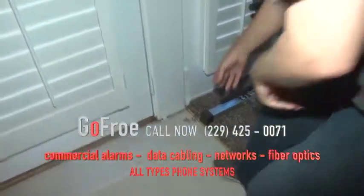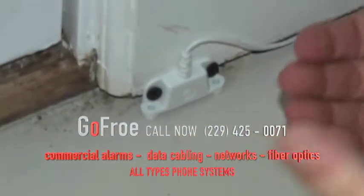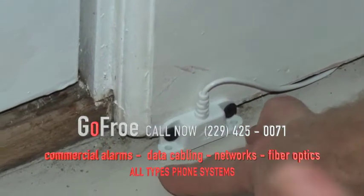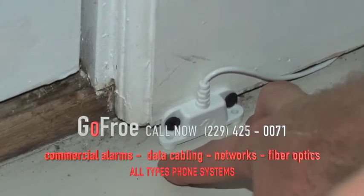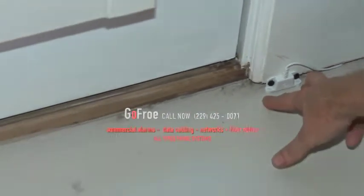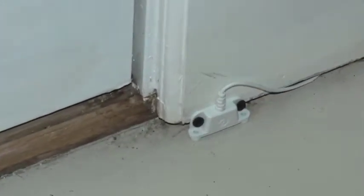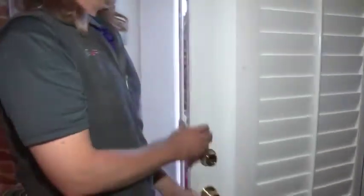You come in the middle of the night, you're already asleep, and you never wake up. So carbon monoxide protection is very important along with smoke detection and heat detection. For this particular home we also have some flood detectors — let's go look. So what we've got here, they've had some water problems before. We've got a flood detector so if any water comes in through this door or under the door frame, there are two metal contacts that'll send an alert to the panel.